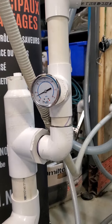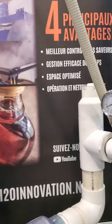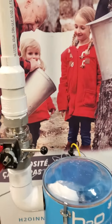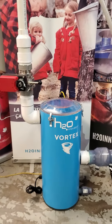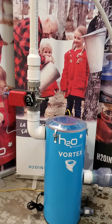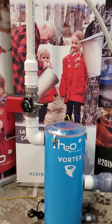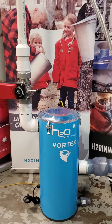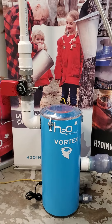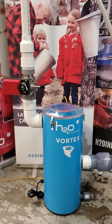This is pretty convenient, especially for people that have one big vacuum pump that brings vacuum to multiple stations — multiple stations with extractors and moisture traps. What they need is that when there's an accident at one station, they want to prevent sap from going into the underground vacuum lines as well, but they also want to isolate that station.